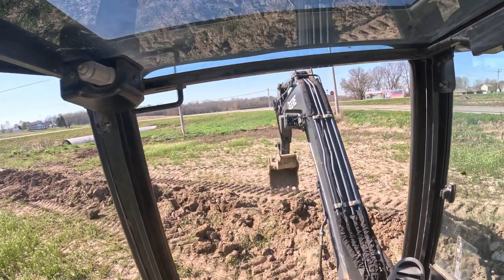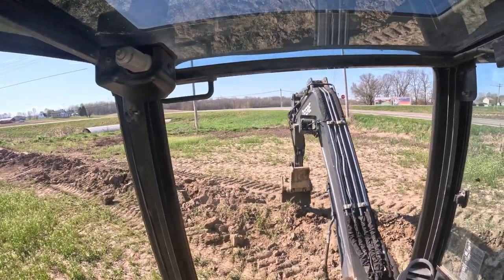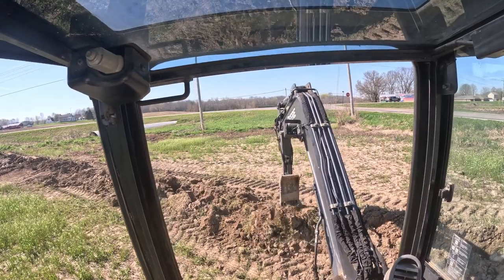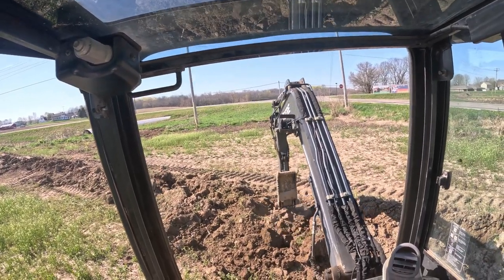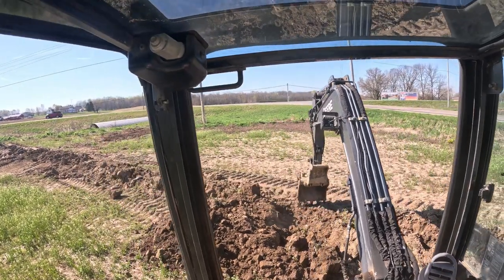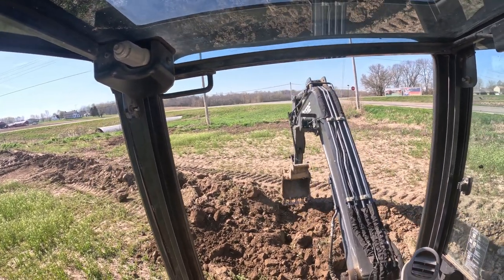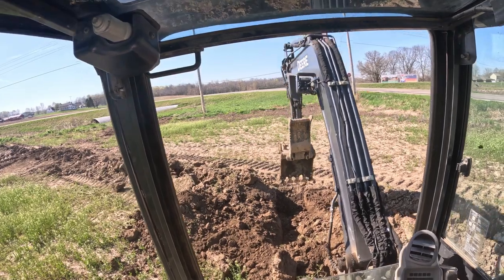Now this is a 6-inch main, so we will actually drill tap tees into it, thanks to Central Plastics, Chris Yoder, their new tap tees. I guess they've been out probably 2 years, maybe longer. Them things are just the cat's meow. The old tap tee styles, they were not that nice. Always worried about them. When I started my business, I worked for another contractor. We used them for a little bit, then switched over. So I, to be honest, have never personally on my jobs installed anything but Central Plastics tap tees. They are way better than what we used to have, and yeah, they are awesome.